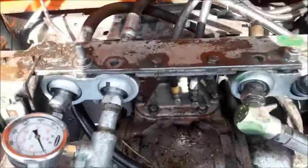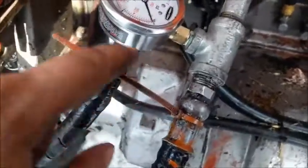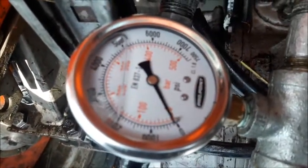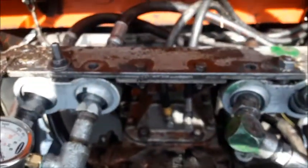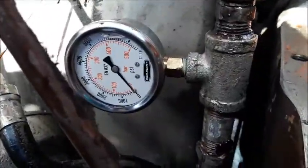We've got to take off the hydraulic here — this is where we piped in our pressure gauge. It only makes close to 100 bar at most, which is about 1500 psi. We're going to pull this stuff off the back here. Inside the lift cover, there's the auxiliary pump and the pressure relief screw for it. We only got 1800 on the pressure gauge so we're going to turn it up a little.